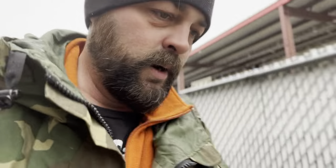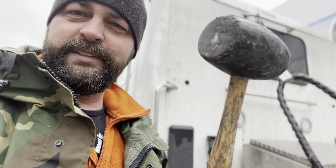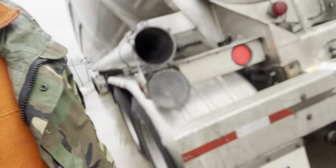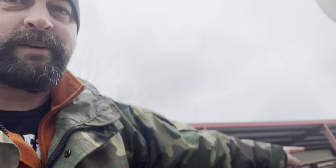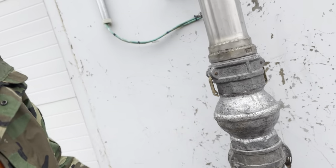So what we have to do — open this up. I have a filter and my beating stick. You want the filter because it filters the flour; you don't want any random crap getting into the silos. We've got all our lines connected. The product hose comes out of the bottom and gets connected to the silo with your filter. The filter can go on the other end of this line too, but I always put it on the silo end. Connect that and connect your product hose.